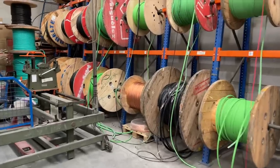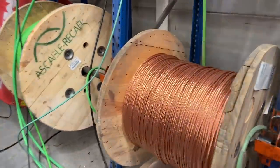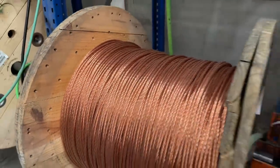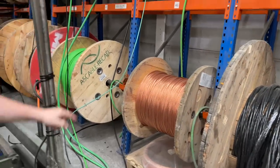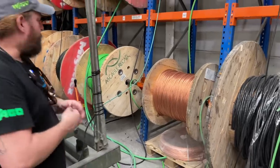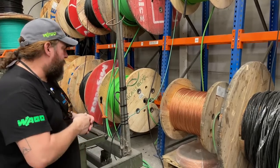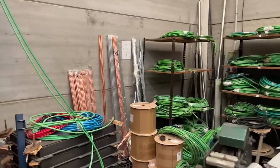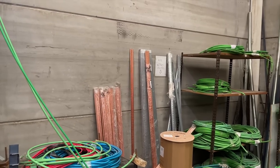And what's the bare copper earth wire for? This goes from the main isolating earth conductor, which we'll come to in a minute. You take off the cover and you can actually separate the earth so there's no earth going into the building. These go straight down to the earth electrodes. So it's never insulated. Never insulated. You put it in one of the black tubes that we saw earlier. Desnudo. Substantial earth rods? Yeah, up to 1 meter 80, 2 meters, and then the other ones are 1 meter 30 thereabouts.